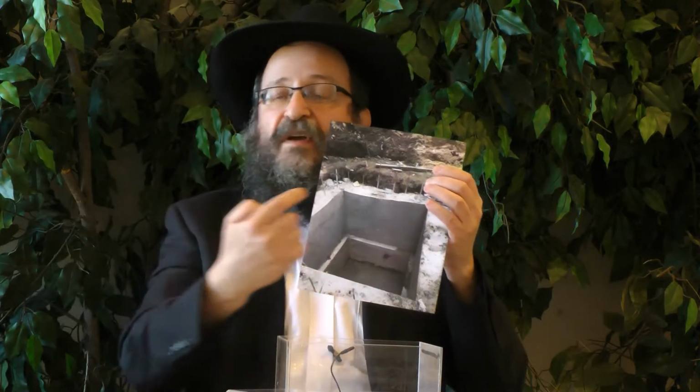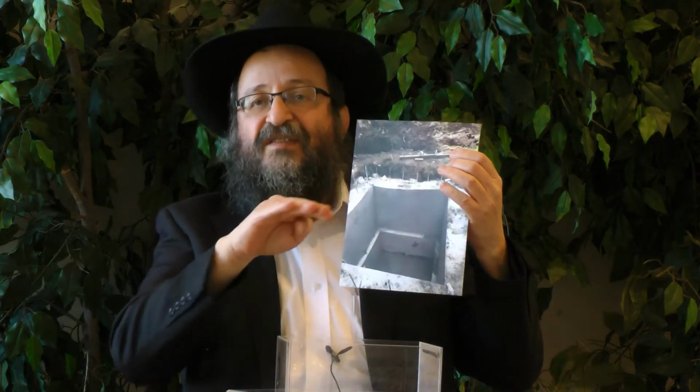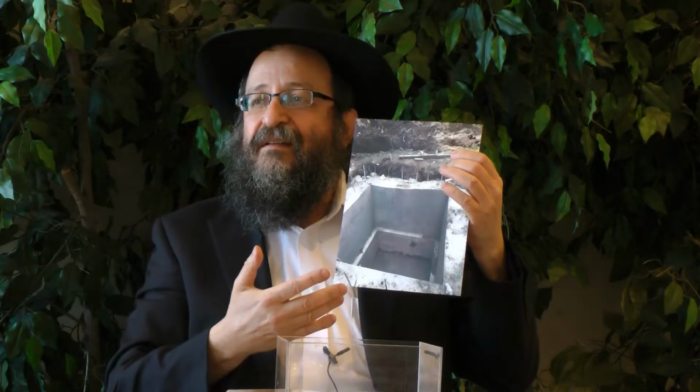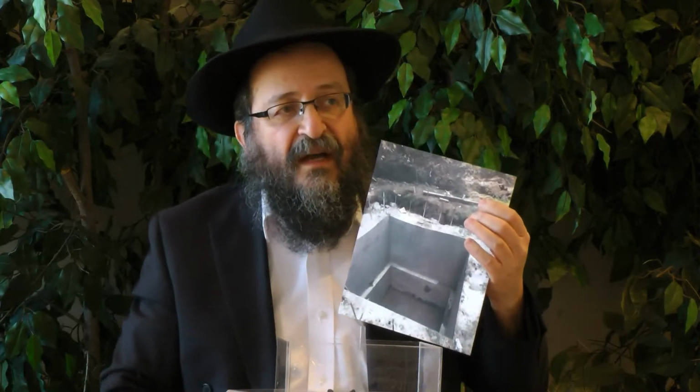What you want, it should be thin enough that it should protect the water from going out, like the rubber of a balloon. But yet, if you pull it, it'll tear. That creates that it's not a keli, it's just a protector, which is perfectly fine. So this is very important to have that sealer before you put the floor. Once you put the floor, you won't be able to seal all over, because where the space of the floor is already cement, you might have a crack behind it. So therefore, when it's all open in one piece, that's when you put your sealer and so on.